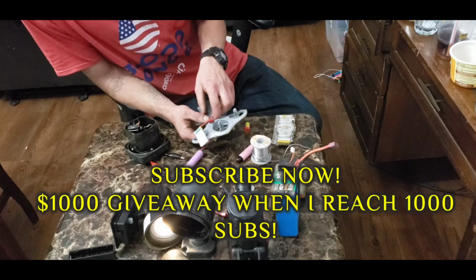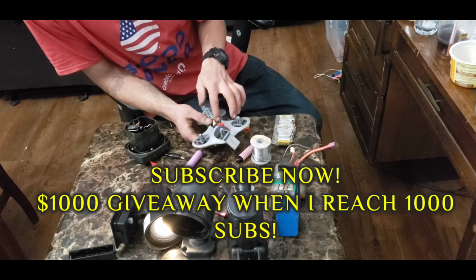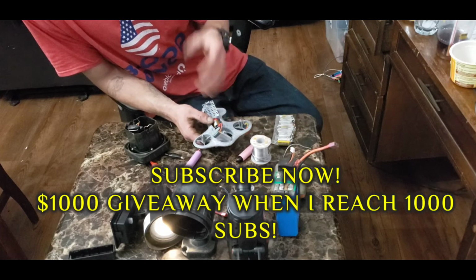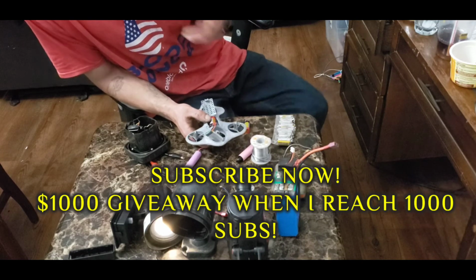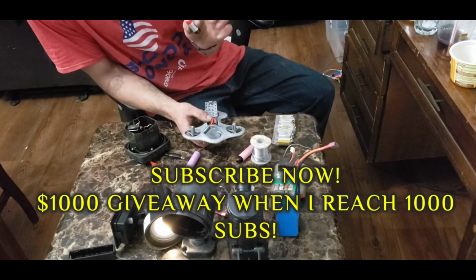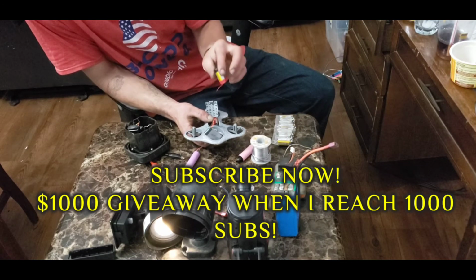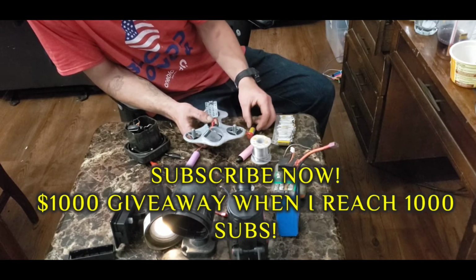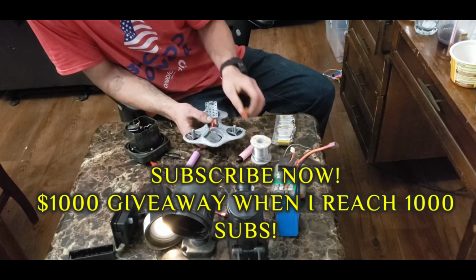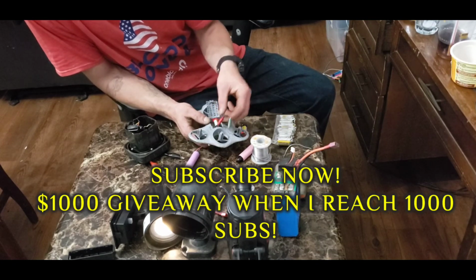And this thing, once you put this plug on here, so if you get another plug like this, you put 2 of these batteries together, put a plug like that on there, not only can you use it to power your drone, but now you can charge it with your drone charger. So whatever charger that originally charges this battery, guess what? It'll charge this battery just as good. So that'll give you another safe way to have a charger for these type of batteries, and it will actually stop charging when it's full, typically on most drones. Not all, so don't quote me on that. But that's another cool little thing about it, because once you change that plug, now the charger will fit it.